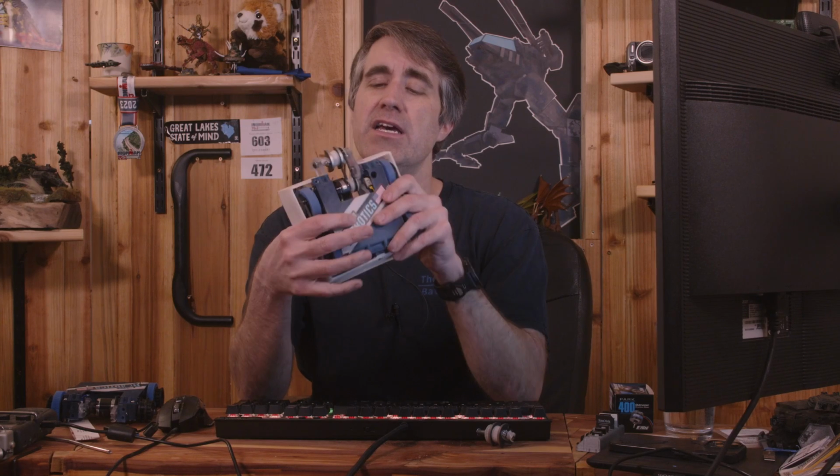And every time you drill a hole through a piece of polycarbonate, you're introducing a new area where a potential failure can occur, because you're essentially reducing the structural integrity of that area of the polycarbonate. In particular, where the weapon shaft goes through, between where the shaft is and the top of the weapon cage piece, there's very little material. And that proved to be the most common weak point in this design when it came to absorbing impacts from enemy robots, or frankly, as I discovered a little bit ago, absorbing impacts from Nylon Brigade's own weapon.